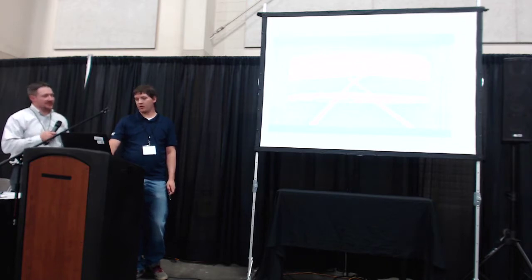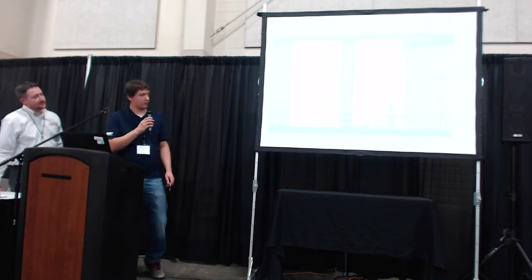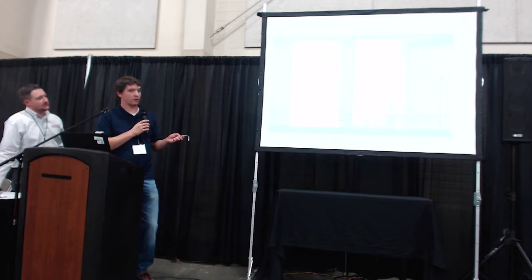We notified the contractor, and this is what they ended up having to do to get that fixed. We made them rotomill a straight line. You can still see the rotomill teeth here. This just kind of raveled off because there was no compaction right there. There was just what the paver put out. So that's probably compacted right around 80%. So there's really nothing there. We really needed to take care of this beforehand, but at least this gave us a good surface to put the SMA on top of to help correct this problem with compaction in this little spot.